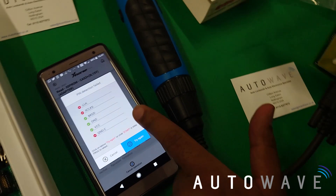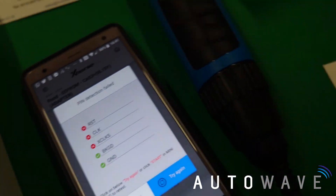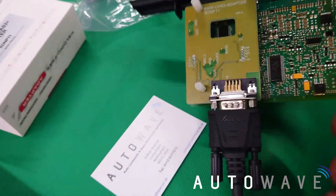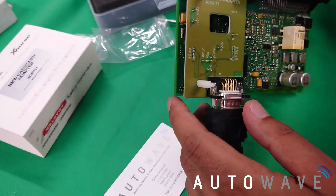We can see it tests the connection — a few of the pins are not correct. On the top of the board you can see it says RST, CLK, XCLKS — they're not right. So I'm going to go ahead and take this off and redo the connections.